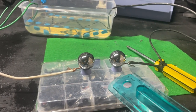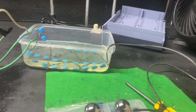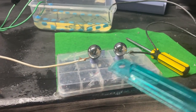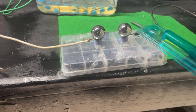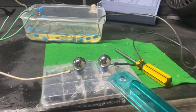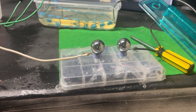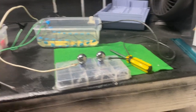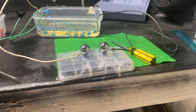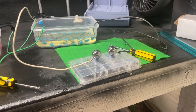Here I've got these two 1-inch steel spheres, and I'll be using these to measure our high voltage. It won't be very accurate because I'm not under standard conditions. We do know the voltage breakdown of air is roughly 3 kilovolts per millimeter, so every millimeter this arc jumps we can assume that's 3 kV. Humidity and pressure can affect arc length and dielectric strength of air, so we're just taking this as an estimate. At the moment, we're hovering around 30 millimeters between the spheres, so jumping this gap should give us roughly 90,000 volts — dropping to about 80,000 volts given the humidity.